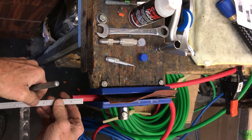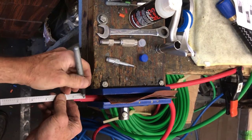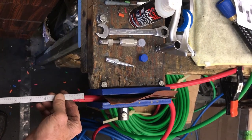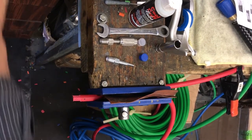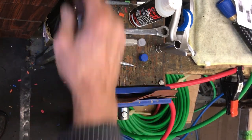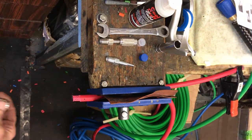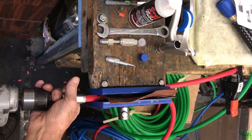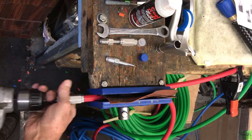Highly recommend you mark it when you're just getting going here — about 7/8". Somewhere between 7/8" and an inch is about right. My gators are kind of cool because they'll spin on you once you get far enough on. Once you get to the right depth, they basically just start spinning.